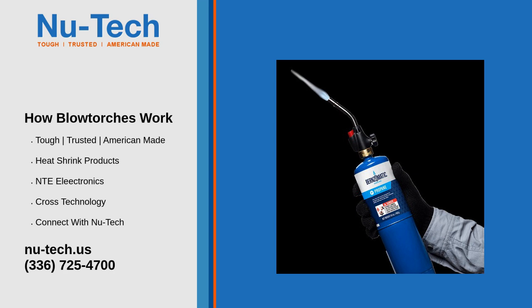Lighting a blowtorch may seem intimidating, but it is merely a sequence of logical steps which can be learned in less than one minute. Start with the fuel: turn the acetylene pressure regulator to set the working pressure, then open the acetylene cylinder slowly to half a turn. The acetylene needle on the blowtorch head is adjusted to the working pressure, then closed again. The same process applies to oxygen. After completing these steps, check the blowtorch for any leaks. To begin the actual lighting, open the acetylene needle on the blowtorch head and light it with the spark igniter. As the black smoke clears, slowly open the oxygen needle valve on the torch head until the volume of acetylene is matched by that of oxygen, although this is not necessarily required.